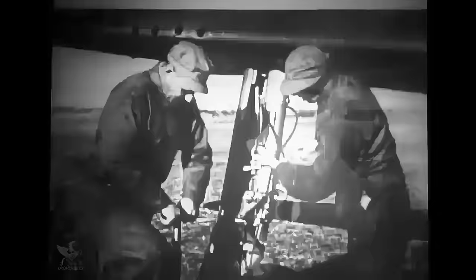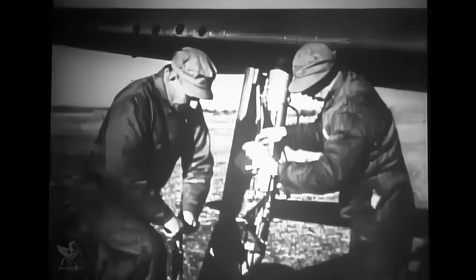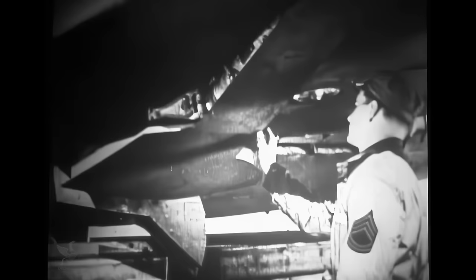90 pounds pressure is pumped into the upper chambers of the shock struts, putting the gauge on the valve to the lower chambers. Next, after making certain that all the switches in the cockpit are in the off position, the battery, which should be brought up to full charge, is installed. Then the crew chief is ready to direct the actual testing of the landing gear, which should be raised and lowered at least 3 times. In the first retraction of the gear, the crew chief should check to see that the inner door and strut fairings fit smoothly in the wing.